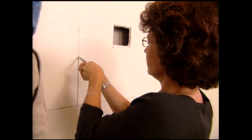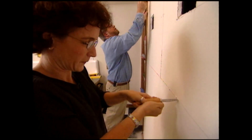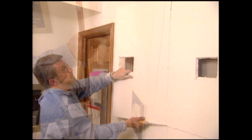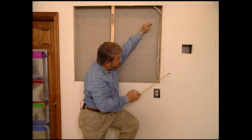Maybe a bulletin board might be fun — like a frame, offset these two. Now we're ready for some cutting. This is a job better done with a handheld wall board saw. It cuts quickly, makes less dust, and lessens the chance we'll accidentally cut through some hidden plumbing or electrical line. We should probably stop about right here — there's a cable running down here. Now these electrical wires here are going to be a problem. I'm going to take this electrical box out, pull these wires up, and run them through this wall stud, down on the inside of the wall on this side, and put a new box in here.